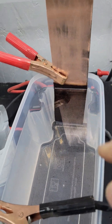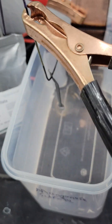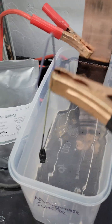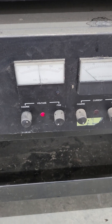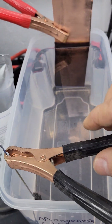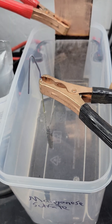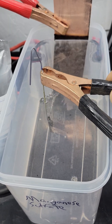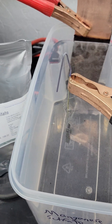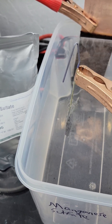I'll just give you a rundown and show you how it works — it's super fast. I've got a copper plate hooked up on the backside, and a sandblasted clip, 120-mesh or 100-mesh aluminum oxide sandblasted. It's already in the solution. We'll hang that up over there, crank on my power supply — it's roughly 100 volts. It's not really pulling much amperage here, so that probably means I don't have a good connection. There we go. You'll see a little bit of sparks and it changes colors. It takes just a minute, maybe 30 seconds or so. Just watch it bubble, and if it stops bubbling, it'll start back up if you give it a little wiggle and get a good connection.